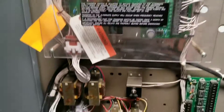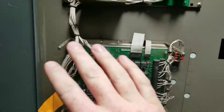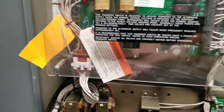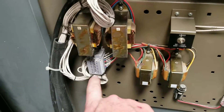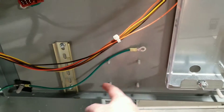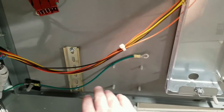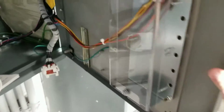Back to what I'm doing: you've got the board, the back plate on, and the new Impact 1500 or 1200 controller on there with the I/O boards. Now we're going to mount these two transformers and this little chunk of din rail onto it. Mount them like this — not like this — because the heat from the bottom transformer will go to the top one and nuke it. Trust me, I know.